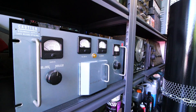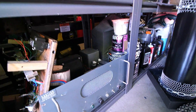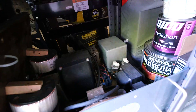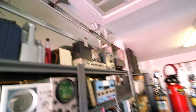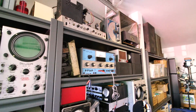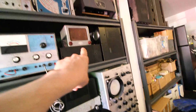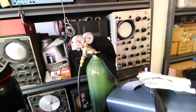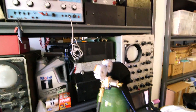This is really neat — a small broadcast transmitter. The modulation transformer and power supply are down in there, and the RF section is on top. It's made by McCurdy and has four 6146s as the RF finals, two on the bottom for modulators, and selenium rectifiers in the bottom. There's also a communications monitor CE5, some scopes for parts, and big amplifiers that came out of movie theaters — those are going to be future projects, a bunch of amplifier builds using older amplifier components.